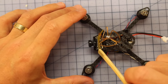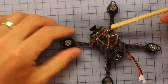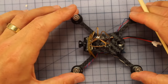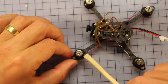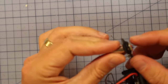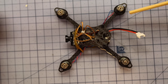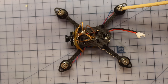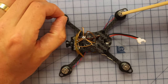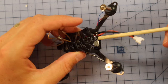Up front you have a 40-channel 25mW VTX. Changing the dip switches can be a little tricky because you need to take the top plate off, which is significantly different from its QX-size brothers. On the arms there are some tiny little holes if you want to add LEDs or extra modifications. The motors are held in with rubber grommets, which seem to work really well. They are 8.5mm motors, which means they'll be a little more powerful than tiny whoop motors but will also draw more current.